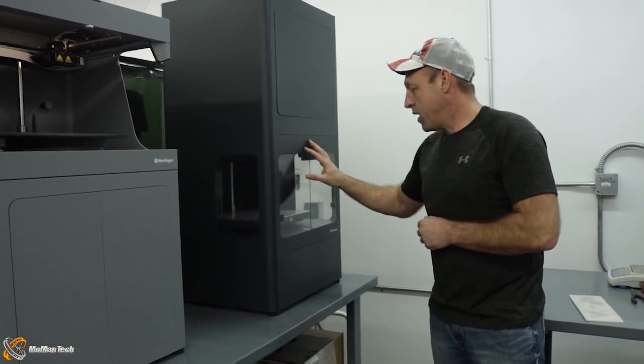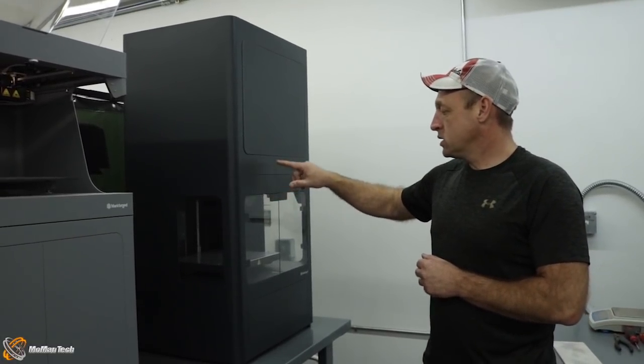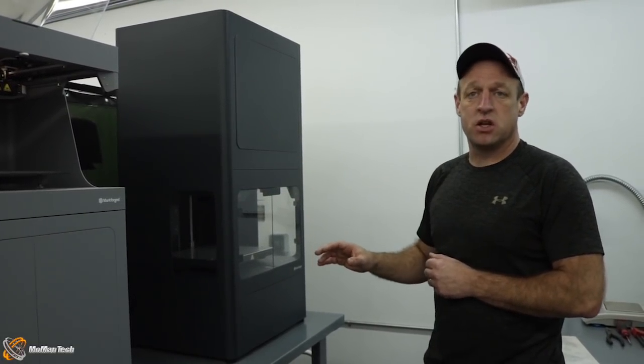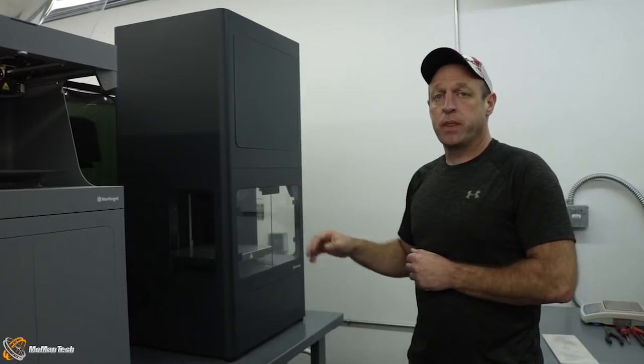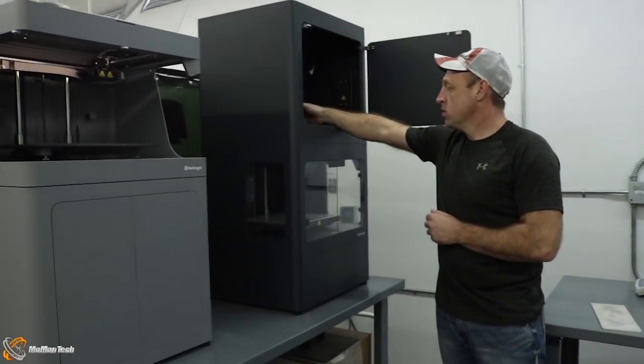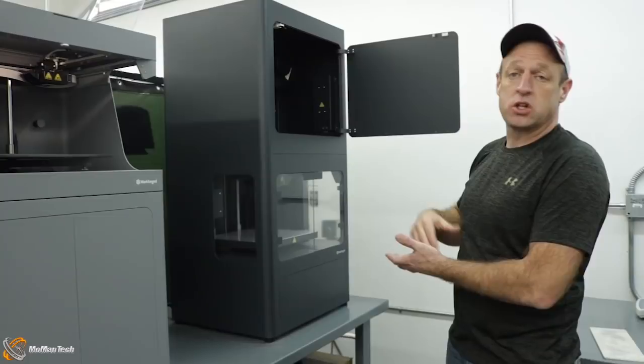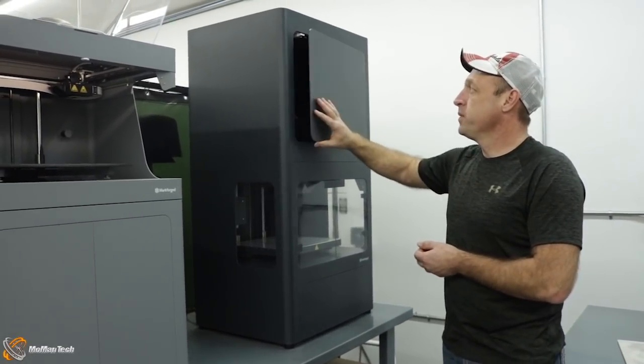We also have a Markforged 3D metal printer. At this time we use a 17-4 stainless steel base material. Again, it's a powdered metal encased in a polymer, heated, laid out, and the part basically grows. It's a pretty neat process.